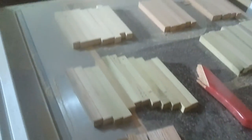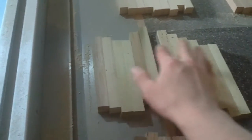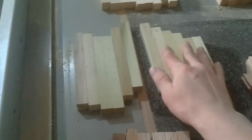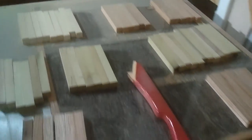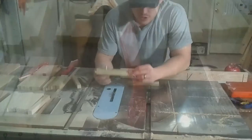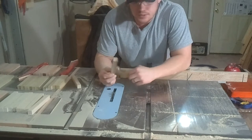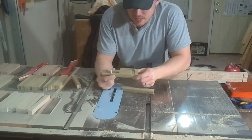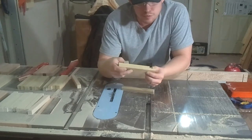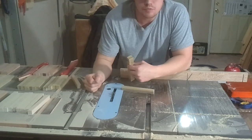I've got them all cut. My final measurement is 11 sixteenths by 11 sixteenths. Some of the wider boards yielded two pieces — this entire setup was actually one trivet I had originally marked out, and there you go, there's six, so there's two of them. Same with some of that white poplar and another piece of green yielded two. I just made my kerf maker and to save some time with all these dados, each piece is going to get three dados. I took my scrap kerf maker and recut my kerf to the half inch thickness of my dado stack.